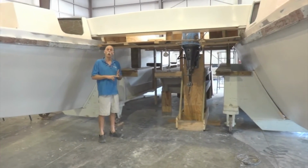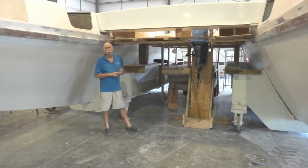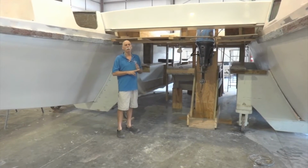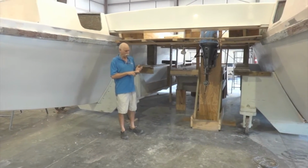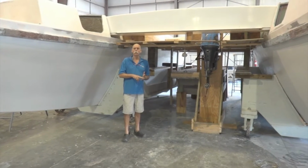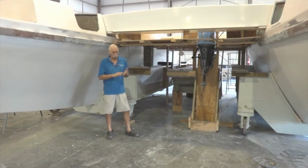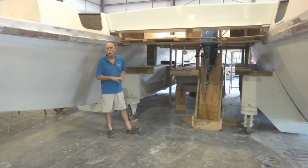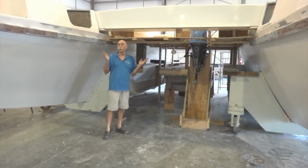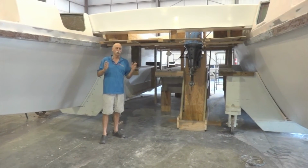The reason it happens to work well for this boat is it has a 2.33 gear ratio, which enables it to swing a larger, more powerful propeller. That'll enable us to have plenty of torque to move this boat. The other thing that it provides is very miserly, really good fuel economy. It's also very quiet. It's also very light. It's a 257 pound motor. That's 5 pounds less than the 60 horsepower high thrust. So when all was said and done, we think these are just terrific motors.